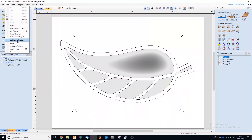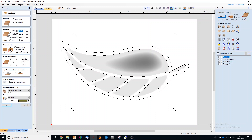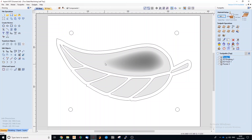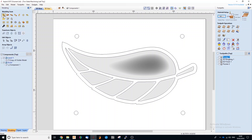Using Aspire, I'm just going to show you here how we've set up our job size and the position. Under the job setup tab, we've got the ability to change to a single sided or double sided job, so we've got that selected. We've defined our job size, our Z0 position and our XY datum position. This is the important part — this is going to be how we physically move the material once it's on our machine bed, so this is the direction we're going to flip between each side. Just press OK on that. I'm not going to go fully in depth on how we've made this vector, but you can use the create vectors tab just here, which will allow you to create shapes that you can then bring into the modelling section and create components at the depths that you specify.